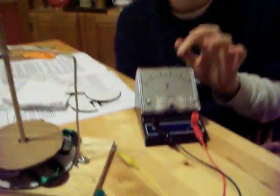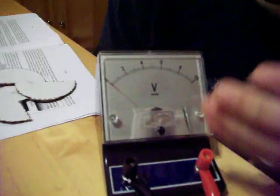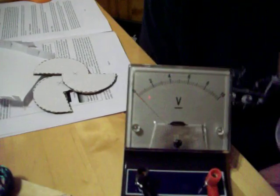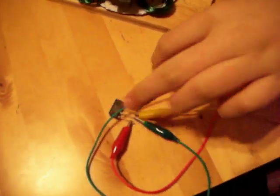These two green and yellow leads lead eventually around to this thing called a rectifier. What a rectifier does is change alternating current to direct current for our voltmeter, which only judges direct current. You see, the needle would be going back and forth in alternating current.